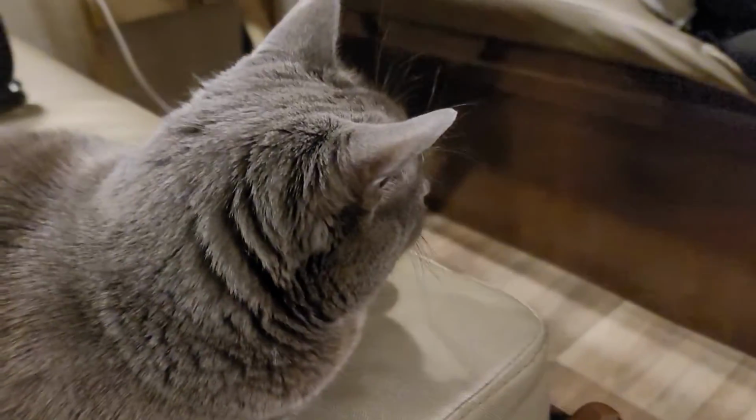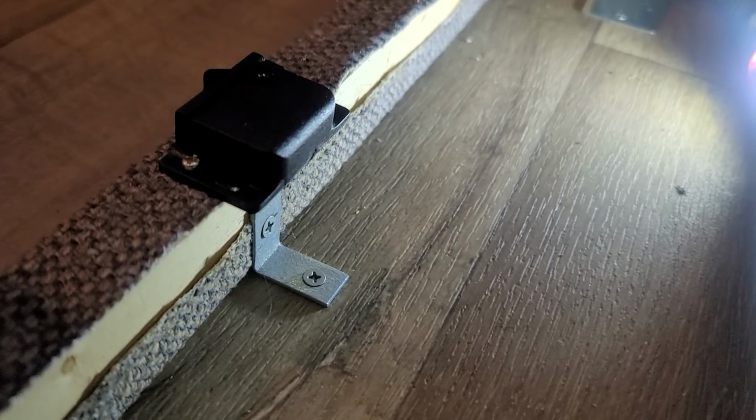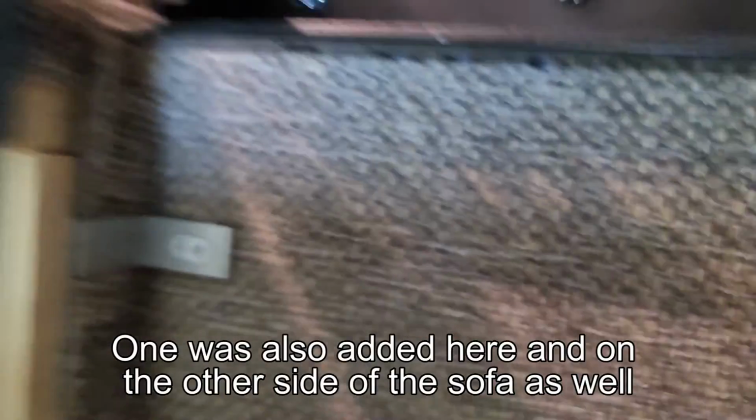Finally, the second most complicated part of the job was installing the drawer catches. This required a lot of trial and error to get it to align just right. I'm sure there's a better and more predictable way of accomplishing this, but we're not exactly cabinet builders by profession. You may also have noticed corner braces behind each of the catches, and we added those because the front face of the Jackknife sofa would otherwise bulge outwards when the drawers were being pulled open.